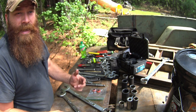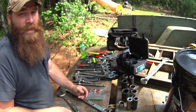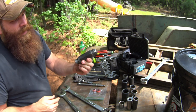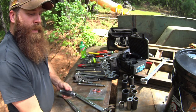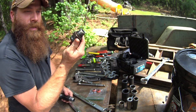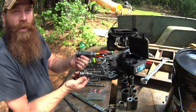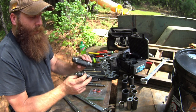I found a whole bunch of them for the 8 and 6 JICs, but at that point the fitting is cheap enough — just replace the fitting. But for these big honkers, that fitting alone from Bobcat is about $170, and the smaller equivalent on top is about the same price. Parker or Weatherhead is probably making these things for a fraction of the cost — it's just finding the part number.